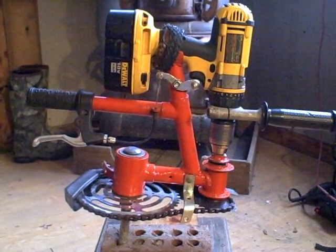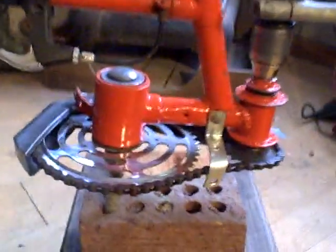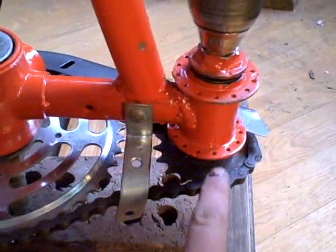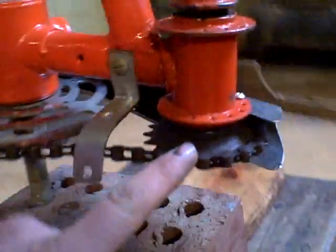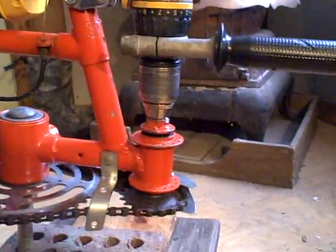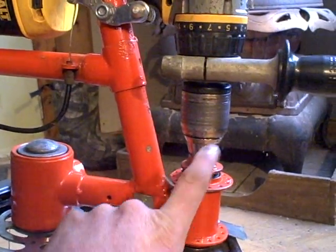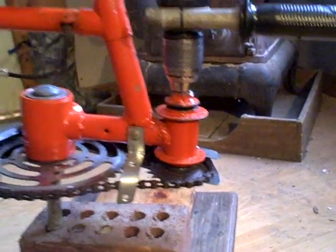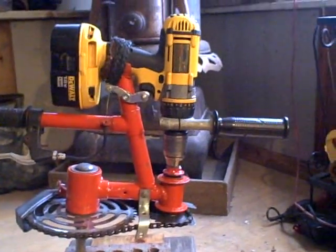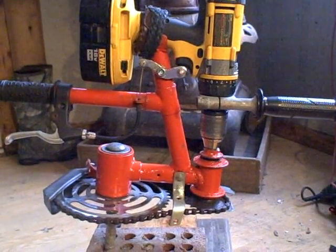So I came up with this. I had a bunch of junk bikes laying around, so I figured I'd start with the gearing. I have a 48-tooth sprocket here and an 18-tooth sprocket here. I welded a grade 8 half-inch bolt through here and got this on a lock nut so everything's removable — it can all be taken apart. The chuck inside here will eventually get worn out, but it's also a replaceable part. Basically it's built out of a few bike parts — it's a 2.5 to 1 gear reduction. It really puts the power down.